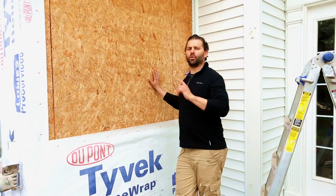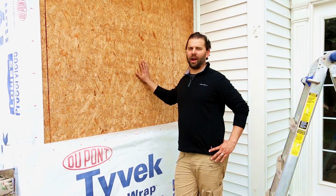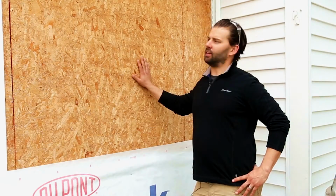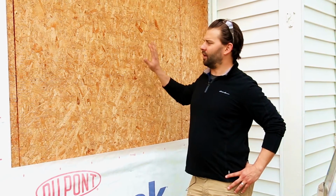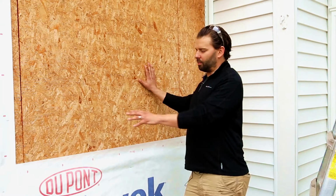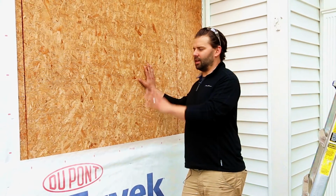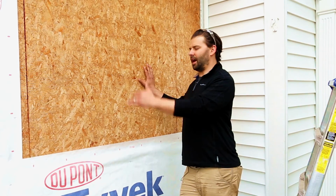Although recently built, many modern homes can be found without house wrap under the vinyl siding. Sounds crazy, but it's true. In this case, we've removed vinyl siding, we find the OSB sheeting on top of the framing, and we're wrapping the house with code-approved Tyvek house wrap. It is always code to wrap a house anytime you remove siding and put siding back on.